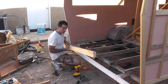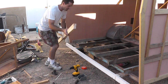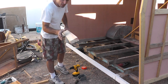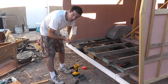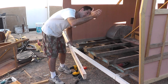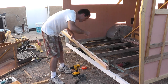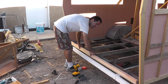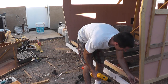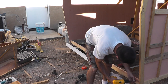I've got this lower floor support cut to the right width, and I am kind of proud of this board. Not only did I rip it to the right width, but I put a nice little taper on it — an angle to correspond with the nice angle on the rear of the trailer. I'll just slip this in right here, using some three-inch exterior deck screws to attach it.